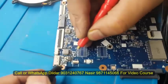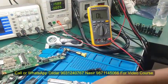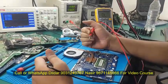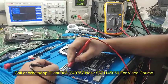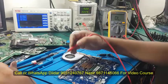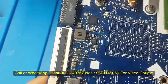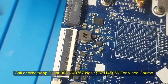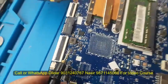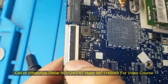The discharging MOSFET is bad - this is a bad area. You will always remember this about this board. I am giving you a solution. This point is wrong in this board, and every time in this dead condition, this is usually wrong. Another problem is that this charging IC gets stuck in the first and second generation of HP. This charging IC, number 8682L, can also be removed from the previous model.